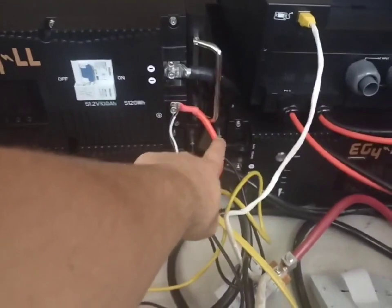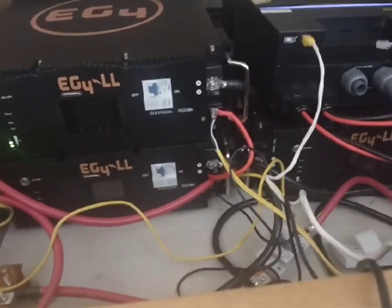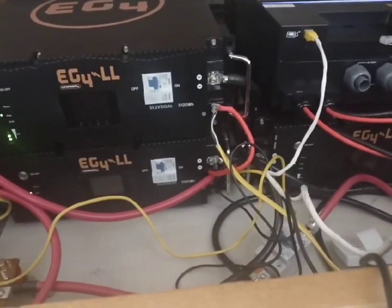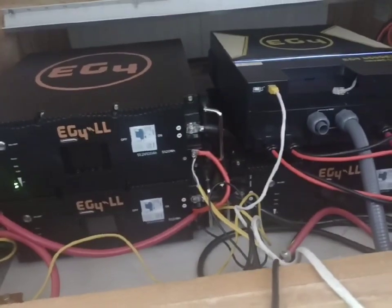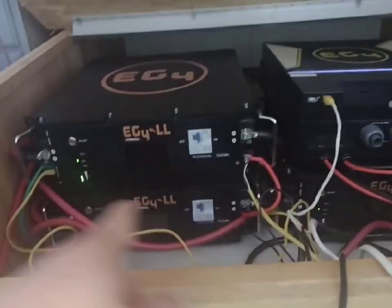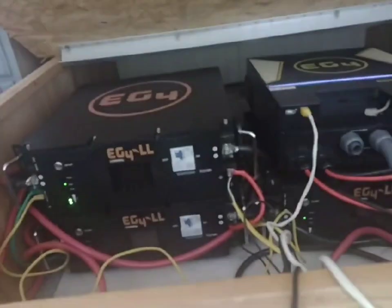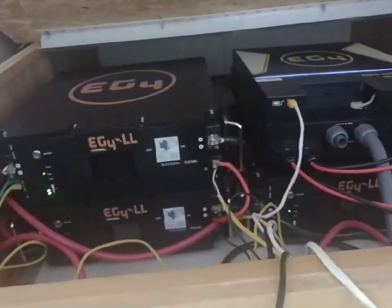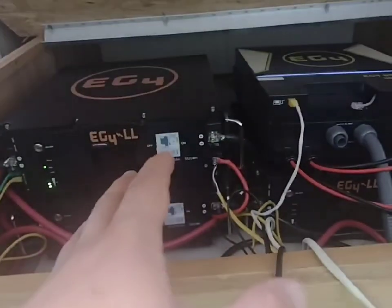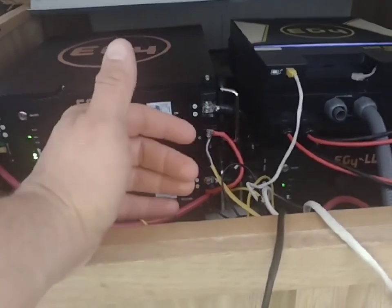This right now, this is ground. For some reason, in my brain, I'm comfortable with, worst case scenario kind of thing, having a little bit thinner wires going to ground. But man, having your full power going, daisy chaining, so having like 3 of these and doing the paralleling or whatever it's called, and then connecting it into an inverter. Holy crap, don't freaking do that. It says in the manual, don't do that. Why is it like this? Why are there two lugs? To be honest, I have no freaking clue. Because you're not supposed to daisy chain it.